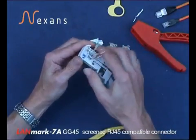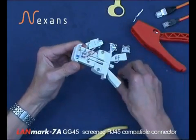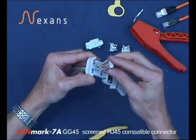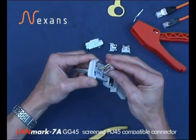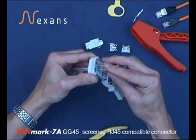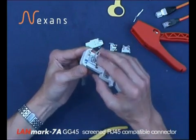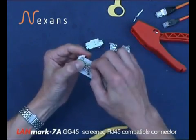Move the shutter back, draw the cable down into the tool and we will place the wire manager over the cores following the correct colour codes, sliding it down onto the tool. Pushing the cable gently up inside the tool so that the foils go inside.